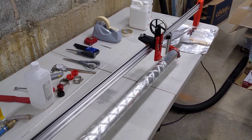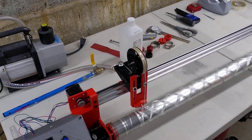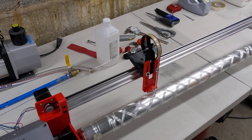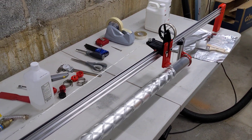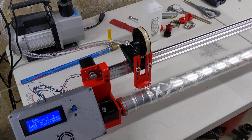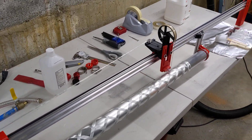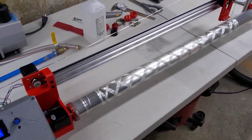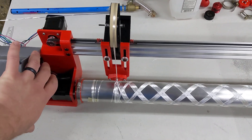This fiberglass is only 93 thousandths wide. When I start running the quarter-inch wide carbon fiber, things will go a lot quicker. I could also get a second spool of fiberglass and run two filaments, though I'd have to redesign my carriage again for a whole second set of guide rollers and a second tension wheel.